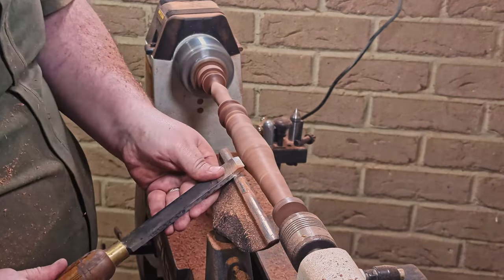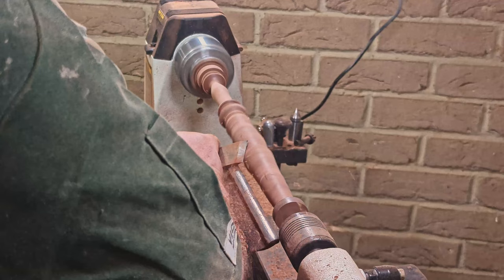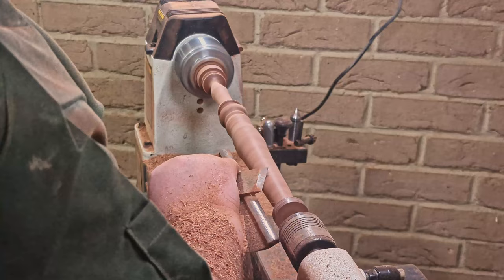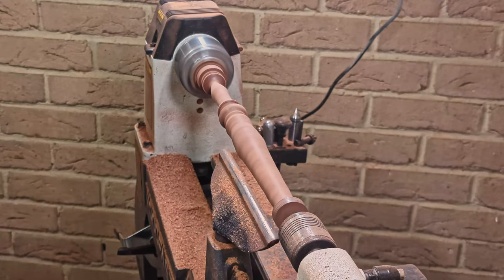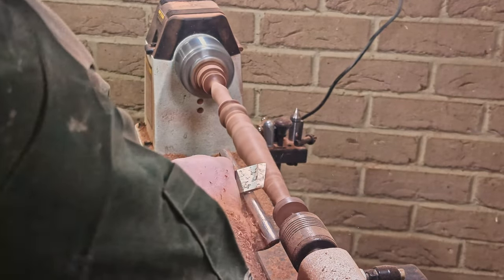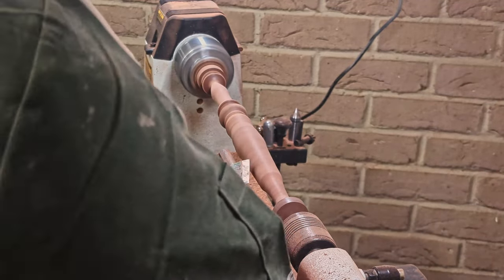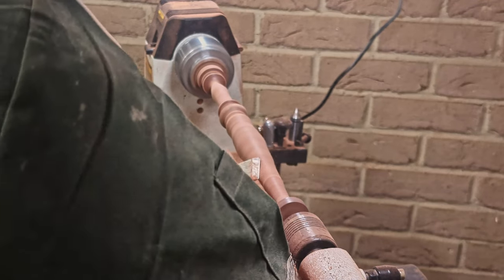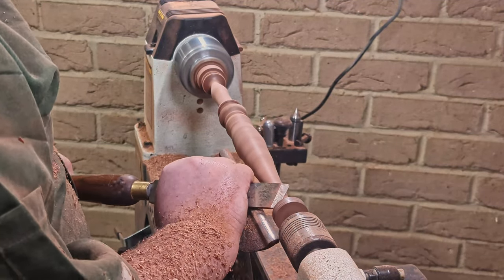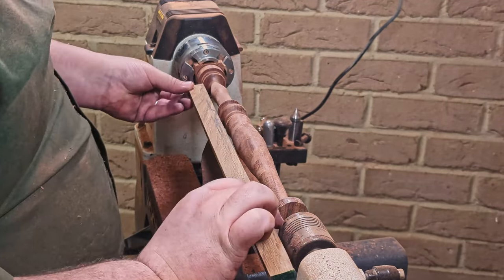What I did there is put a little V-groove in the end at about the 36cm mark, then worked down from that edge and worked back to it, as Sid recommended. There was quite a bit of chatter, and most of the chatter was dead centre — not at each end, because each end is supported. You'll see me in the next couple of clips really using my hand on the back. That works really well because the skew leaves quite a nice flat finish to work with, so it doesn't give you any random splinters.